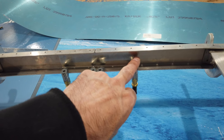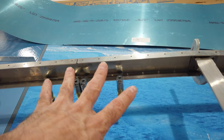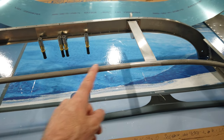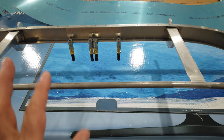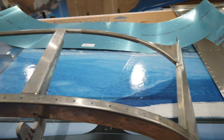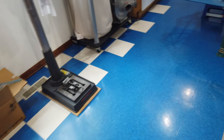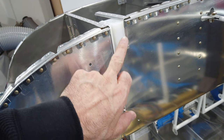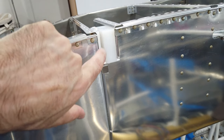There is a splice plate that I have clecoed in place with these clamps. Without the splice plate in place, the whole frame is a wobbly mess and the only thing holding it together is this small piece of tubing, so be very careful when handling the frame so that you do not bend this tube. On the fuselage itself there are these white pieces — I think they might be nylon — and they provide the space for the hinge to slide into.